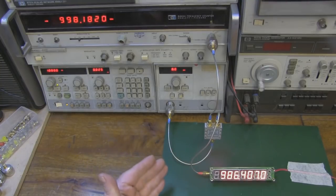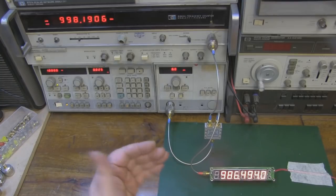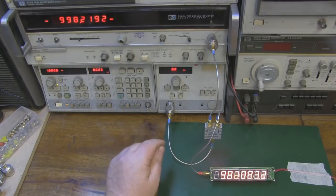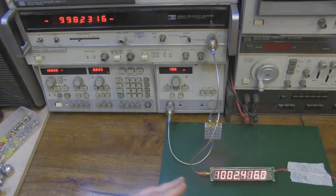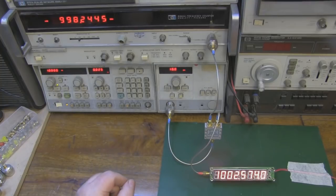What tends to happen is that measuring equipment for higher frequencies really jumps up in price — it quadruples because it gets more and more expensive as the frequencies get harder to measure. At 986, it's certainly pretty close; I wouldn't grumble at that. Let's add a little more power and go up to 10 dBm — at 10 dB it's reading a lot closer to one gigahertz. So this definitely needs a higher power input signal to read the higher frequencies. Let's try 1.5 gigahertz and see how well it copes.